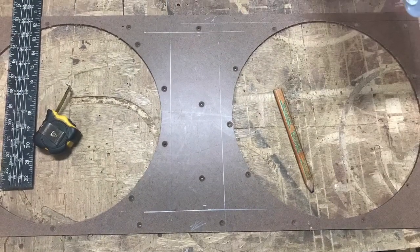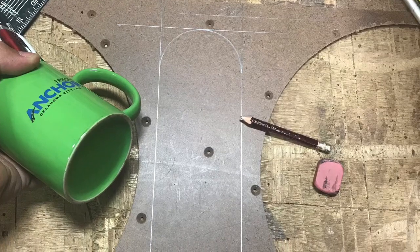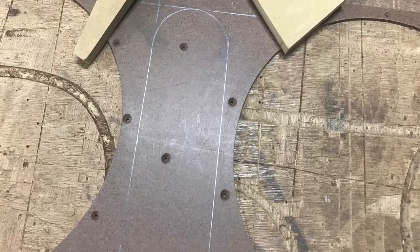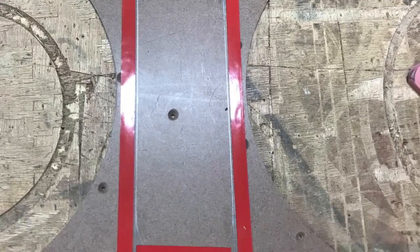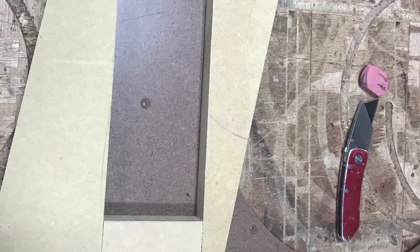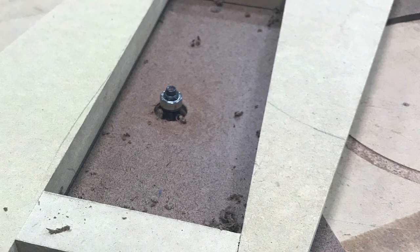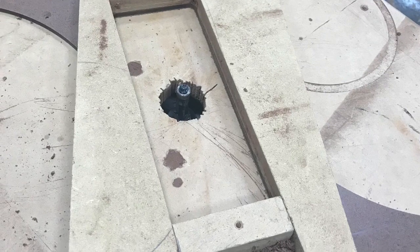Lined out. Grabbed something around the shop — an old coffee cup — got the top and bottom parts arched out like I want. I'll go ahead and use my scrap pieces as templates with some double face tape, press those into place, box it off, and then cut the arches out by hand with the jigsaw. Get a flush trim bit and once around on that then I can pop these back loose and get with that jigsaw, work that top and bottom arch.